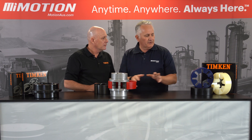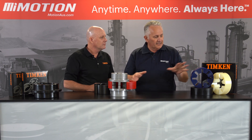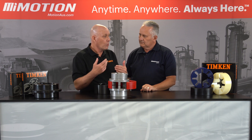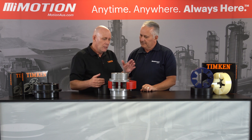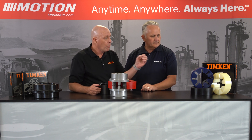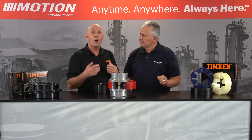So we look at these elements here and notice we've got a different range of elements in colors. They relate to different hardnesses, which means different torque or power that you can transmit. The red one being the softest, blue medium, black the hardest. The white one is the same hardness as the blue but is a high temperature element.